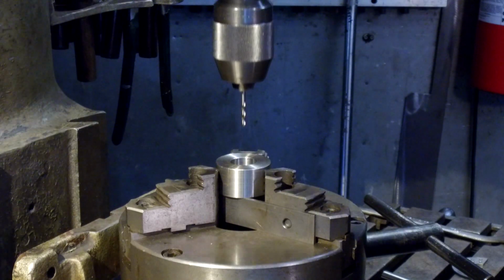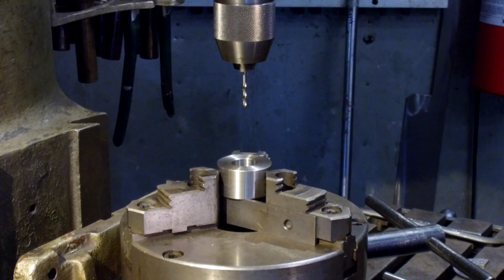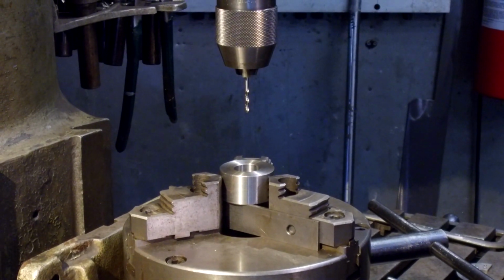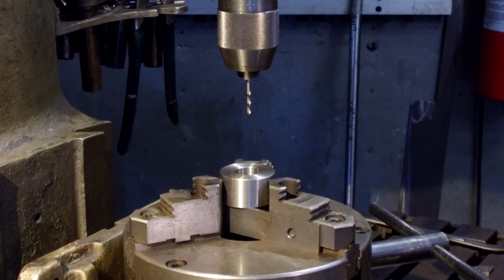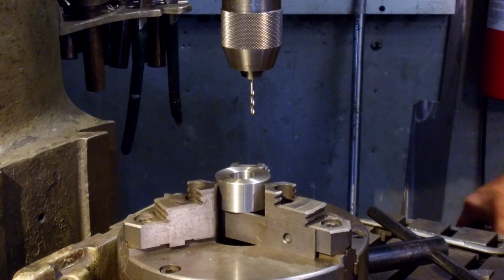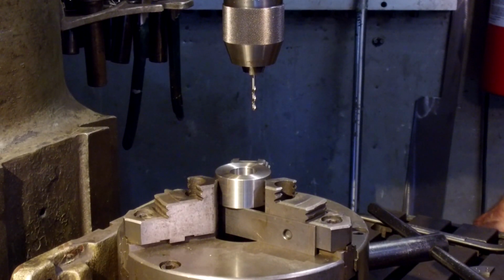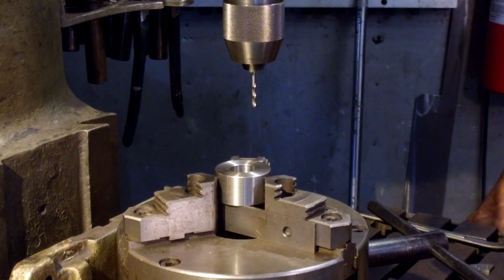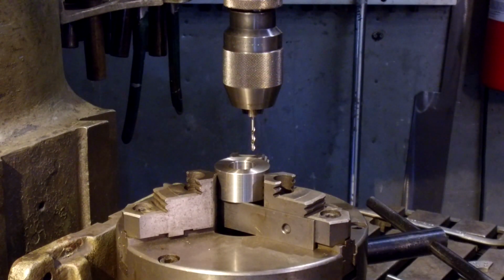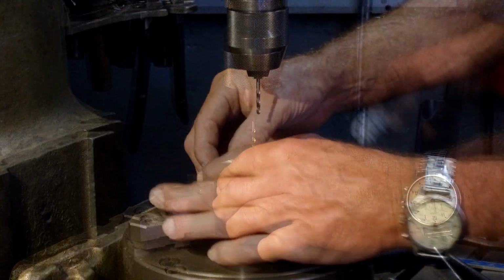All right, now we're center. We want to come over half of our bolt circle or hole circle, which is 0.688. So we're going to do that, and we're going to come over here, 0.688. All right, there we go. Now, that's pretty close to being on that split line. I didn't put this in real tight, so I wanted to be able to rotate this around.